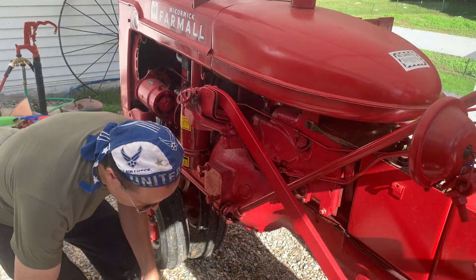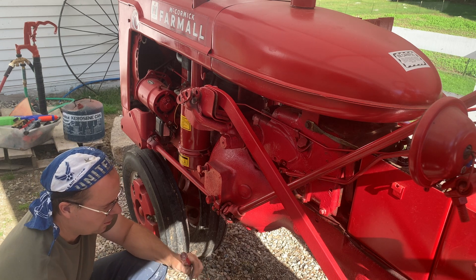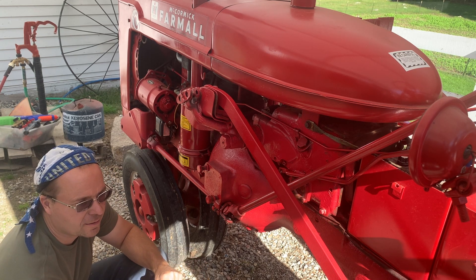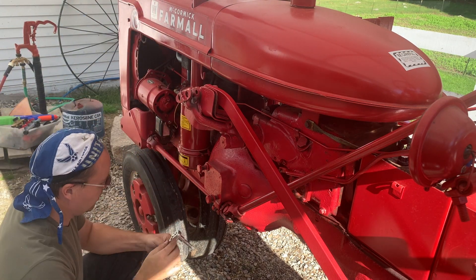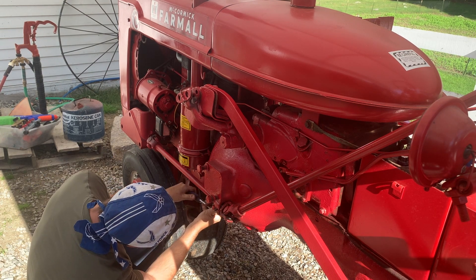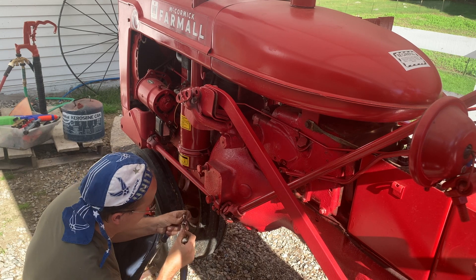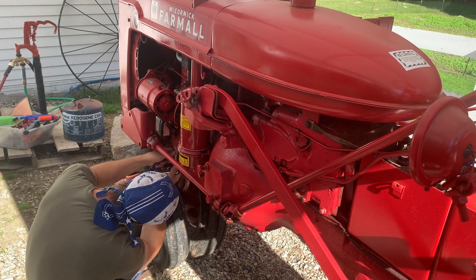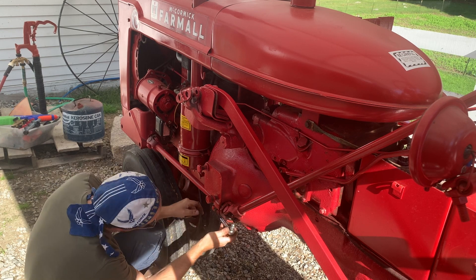The intention is, if it stops raining long enough and the ground dries out, I need to go turn the soil over in the garden, so I'm going to use the Super C and my two-bottom plow. We're just finishing up getting this ready to use. The tractor's been greased, the oil's been changed, everything is in good shape. I just realized I need to tighten up these nuts or bolts on the oil pan just a little bit — for some reason they weep around the gasket. I don't know why those get loose, but I sure don't want to snap them off up in there.